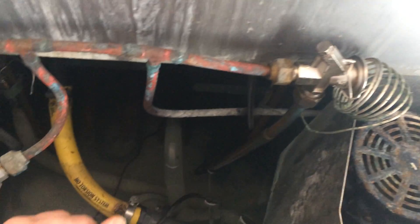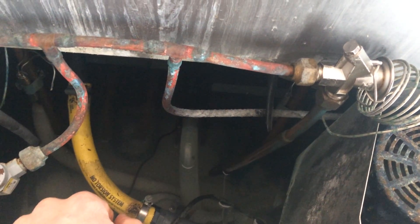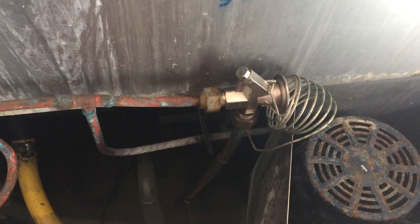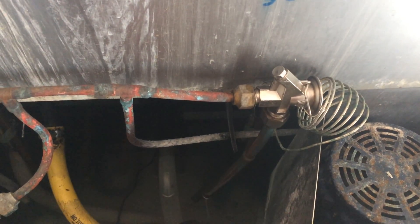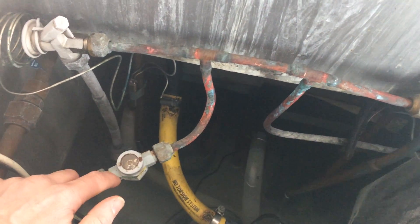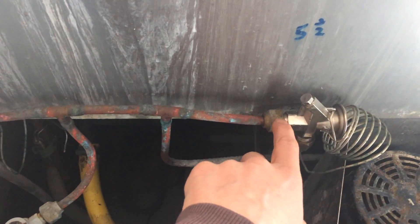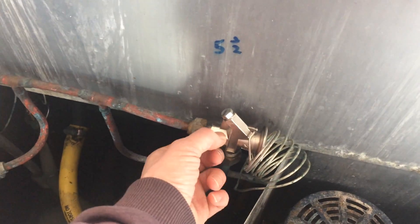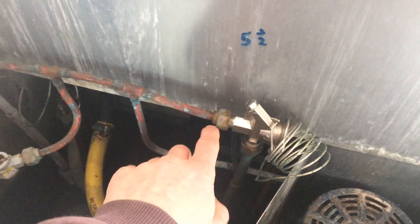This should be above zero at all times. Couldn't see any leaks around any of the valves on the outlets. We'll go around them all and check them before we go. I think we're going to need a new sight glass and new filter dryer. We'll have a look in here and see if it looks like it's wet — sometimes you'll see actual drips of water inside. The other thing I've had with these is the little filters get blocked up.